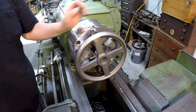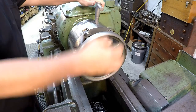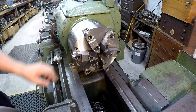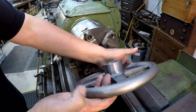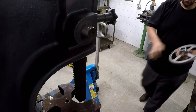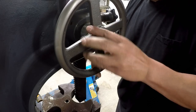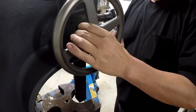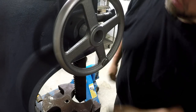Corners look good, so we'll take it out and go test fit it. I'll come back to the lathe and give it a good wipe down to get rid of all the cast iron dust. There's our bored hand wheel — looks like we've got a good fit right there. One thou clearance. Let's go to the mill.